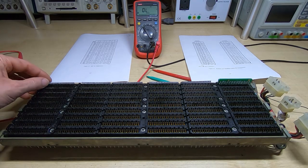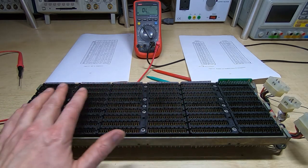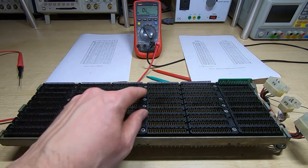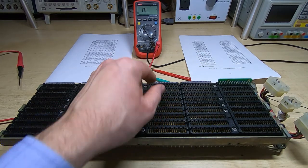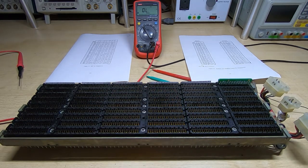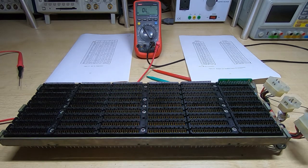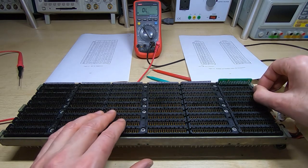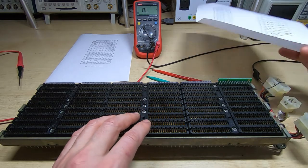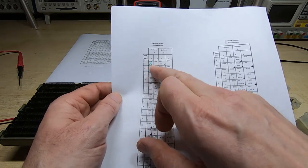To save myself a bit of time, what I tend to do is put these little marker papers at the back — they just slot in between the connector and the metal housing, and it just saves you having to count it up each time. I then connect the multimeter to one of the pins — in this case I'm going to connect it to the first one, so this is pin A1. I then look to see what the signal is; in this case it's INIT L.